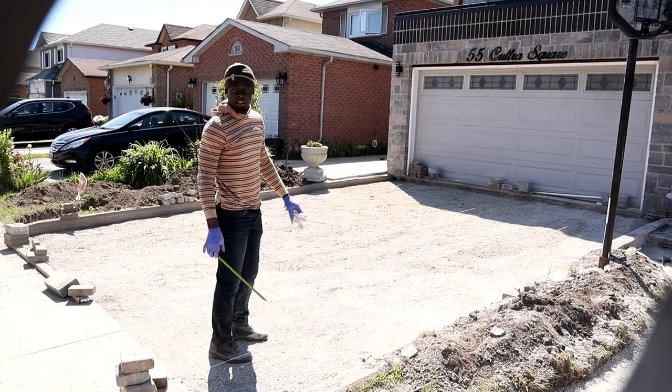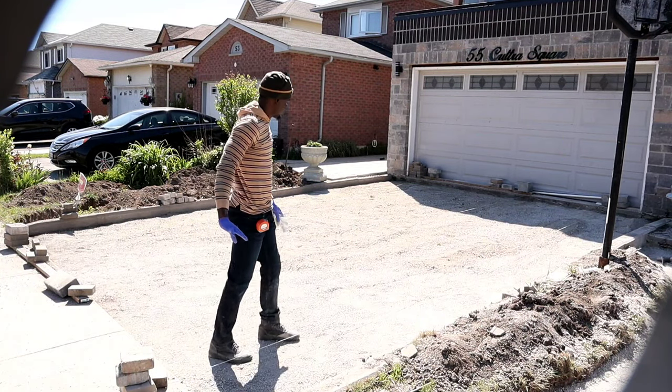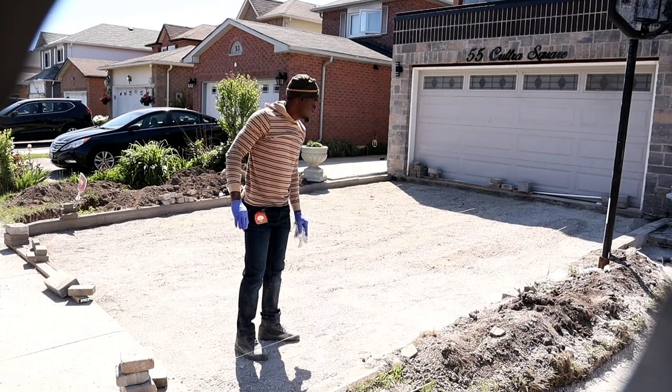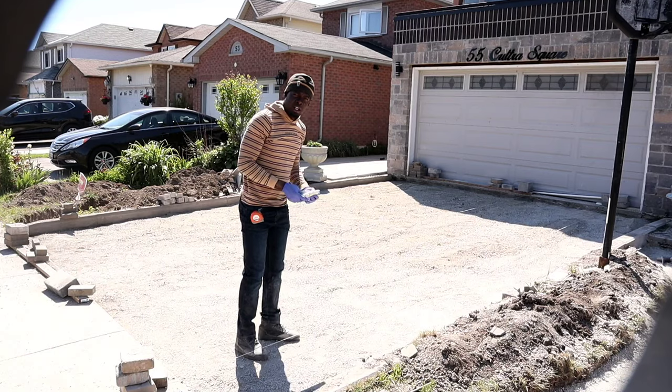After, we're gonna put a layer of finishing sand. Okay, so we're just catching our level to 4 inches. Then we're gonna stamp it and compact it. Then we put a 1 inch layer of sand over it.